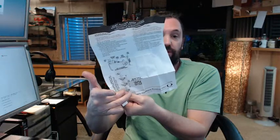With the fold line of template against the jamb, or what they call a metal Z-bar, which is a stop, is where you're going to install that. Whatever projects further out. And then you will mark your holes, these 3 holes here, 5/16 holes. Drill straight through the door. You want to be careful doing that. Just be careful doing it, of course. Assemble outside of components per the sketch, and you can fire up that installation link.